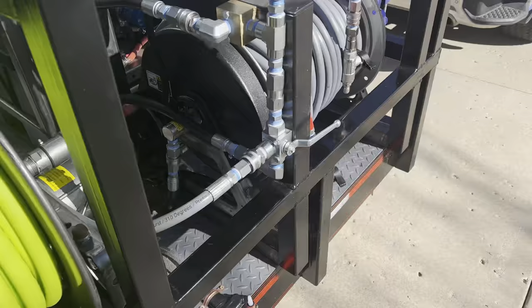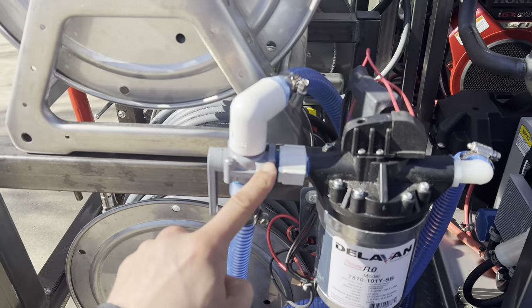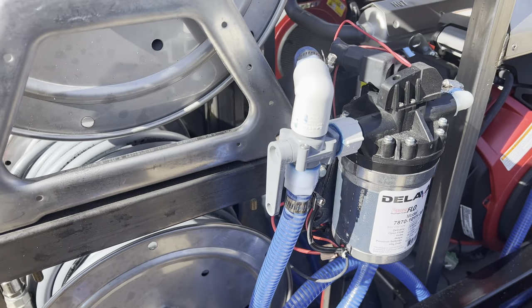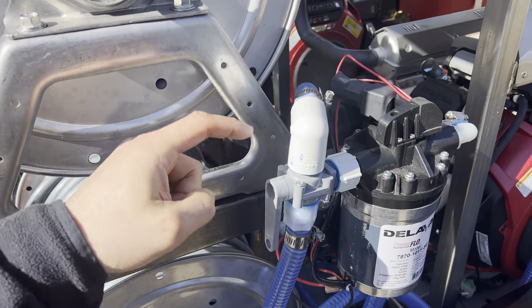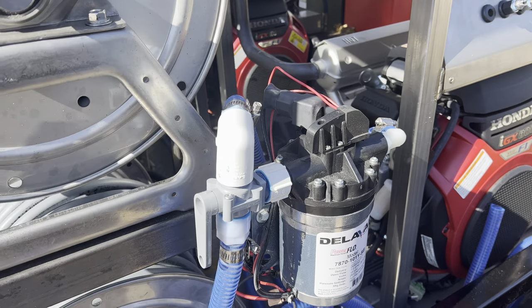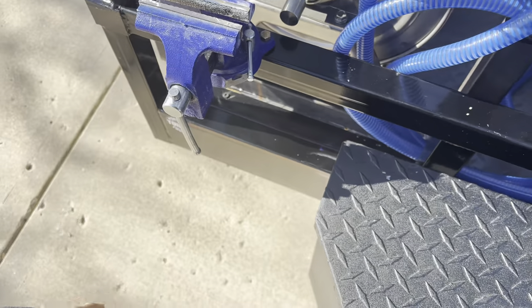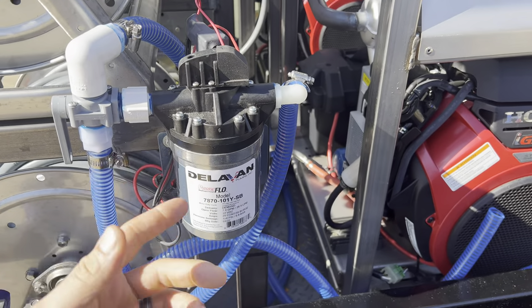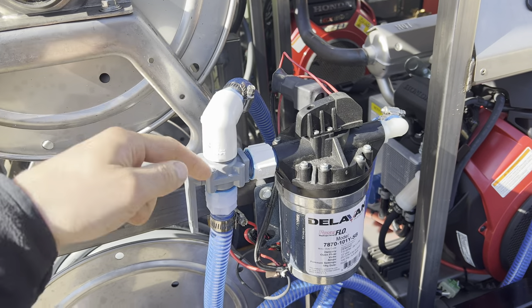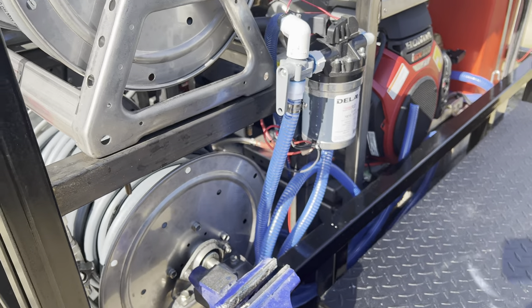On the outlet I have a three-way valve from US Plastics — small profile, great valve. One position goes to the tank and fills it. When rinsing with water I don't want to put water in my SH tank, so the valve goes to the down position where a hose lets me pour it on the ground, keeping it out of the tank. This also traps bleach in the line and rinses it out with fresh water so it's ready for next time.